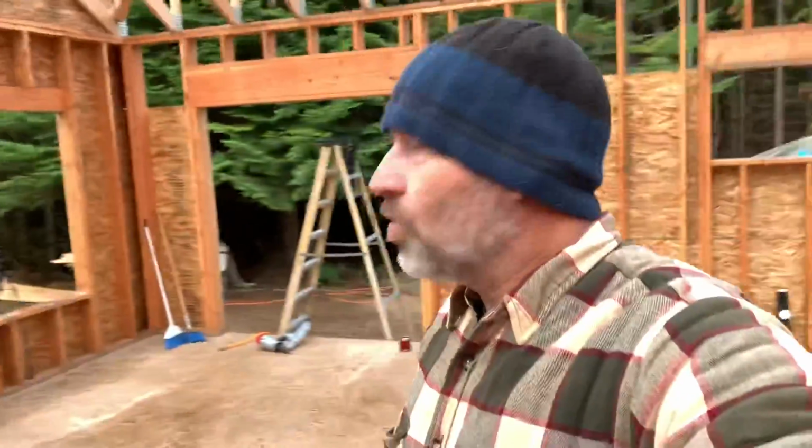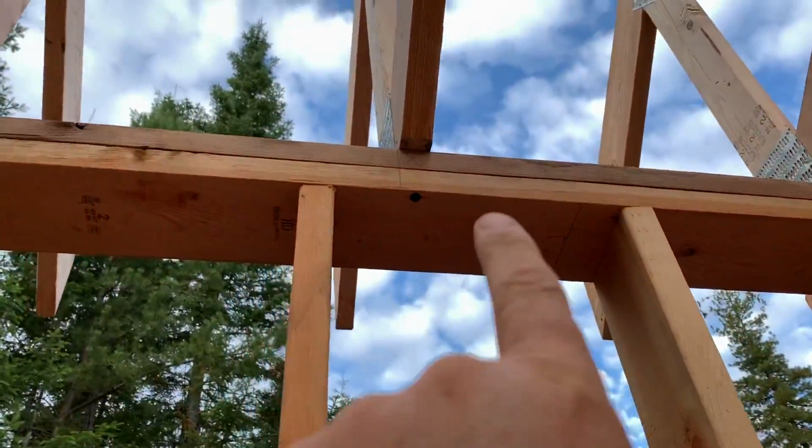Oh, here's something that's cool. You probably saw it in the video yesterday, but let's go look on this side so that the lighting's better. We used some pretty cool 6-inch screws. Right here, you can see right there. Those are called timber lock screws. There's a link down in the description if you wanna check them out. But timber lock screws replace hurricane ties, and they're super fast and super easy to use. And they're in, man, and that truss is locked down.